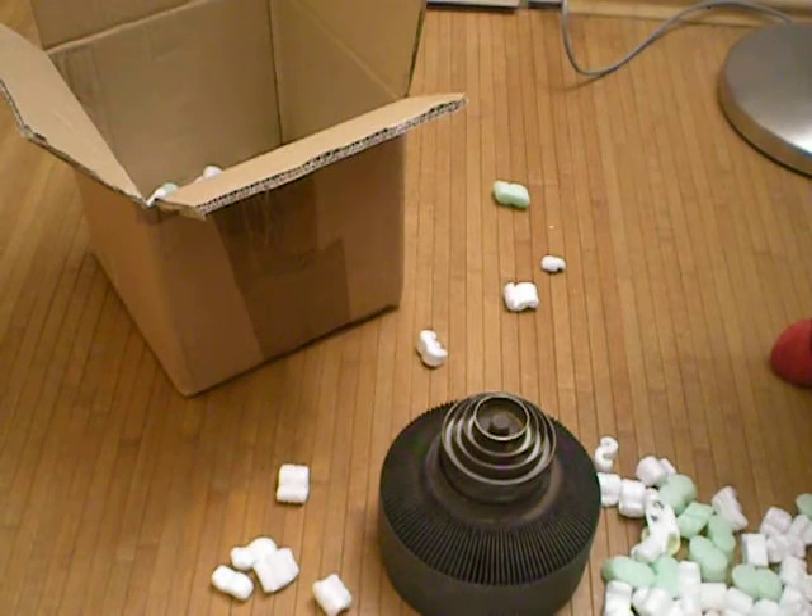This thing is more powerful than Tristan's GU39B-1 — he's very fussy with the dash-one part of it. The GU39B-1 has 8 kilowatts dissipation; this thing's got 10 kilowatts. It's probably going to have a B-plus voltage of something around 5 to 10,000 volts, which is going to be lots of fun. I might build a VTTC with this, but I'm going to have to see.